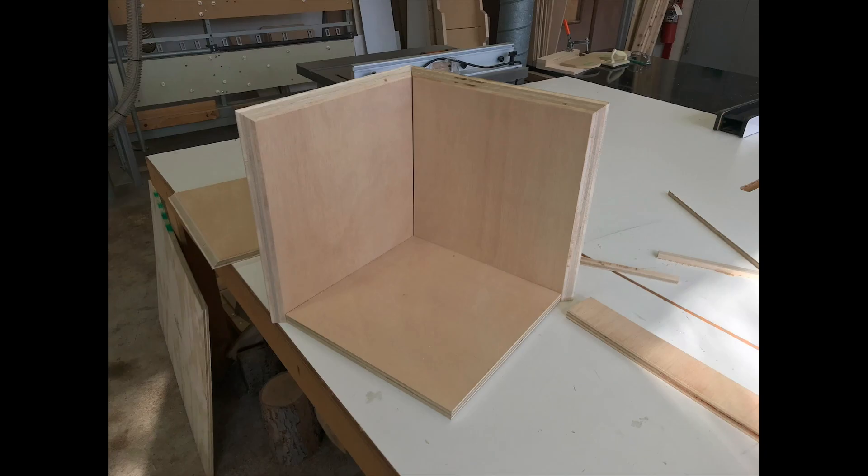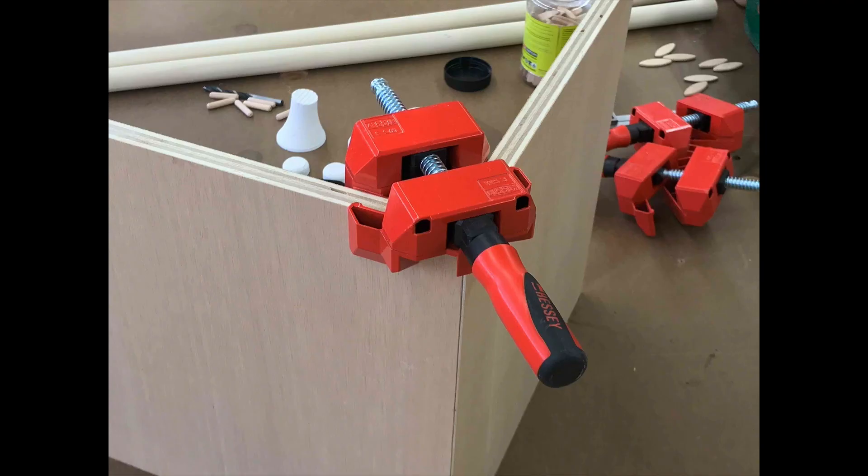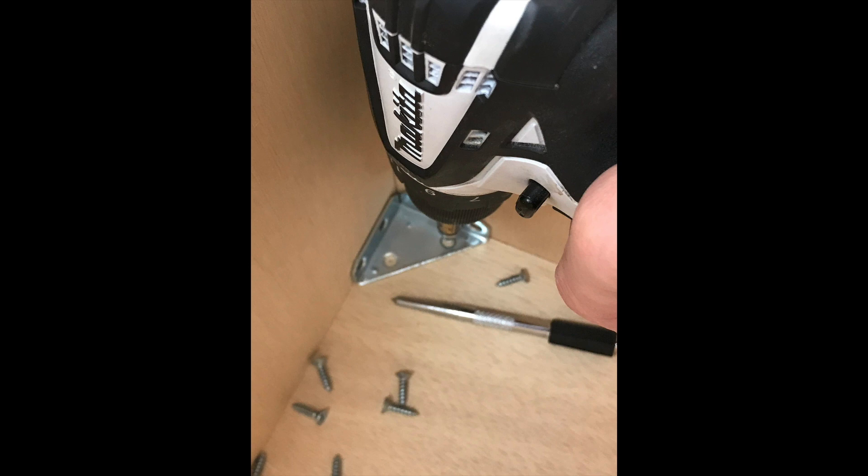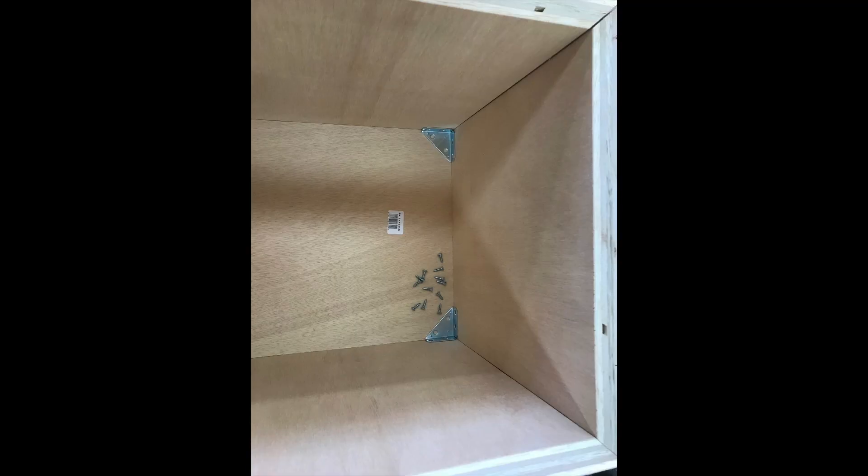Now how do you get all this stuff together? You can use corner clamps to put these parts together — they are very useful. And then, as you can see here, I used brackets to drill these parts together. A little tip: I used a center punch and moved my cursor right there, so I pushed in a little bit. This way you can drive the screw right at the center of the opening. Because if the screw moves a little bit, it might actually also move the bracket, and then you start having seams opening, which is really frustrating.